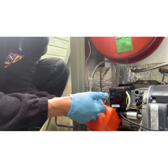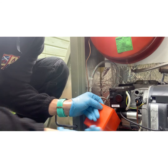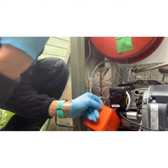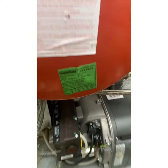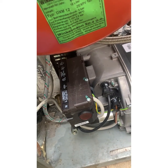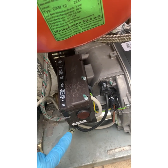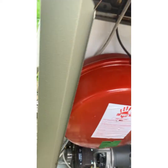Once that's running clear oil through, we'll put the photo cell back in and then get fired up. And now as you can hear it's going — I've put the bleed screw back in, photo cell's back in, fired up fine because I let it run clear. Beautiful.